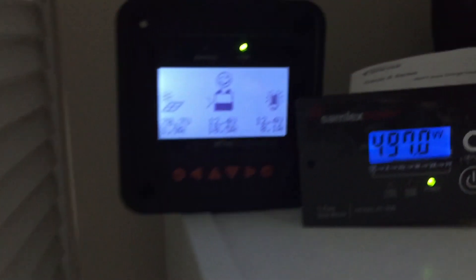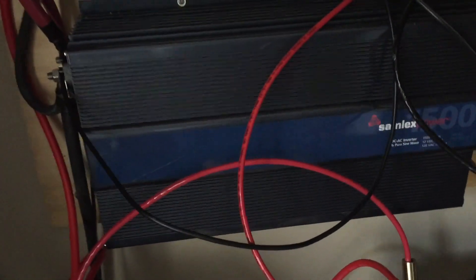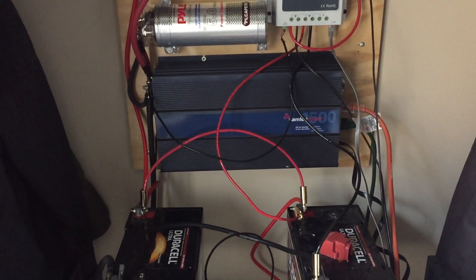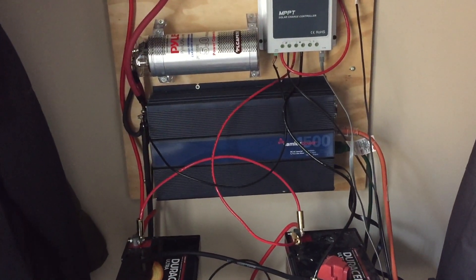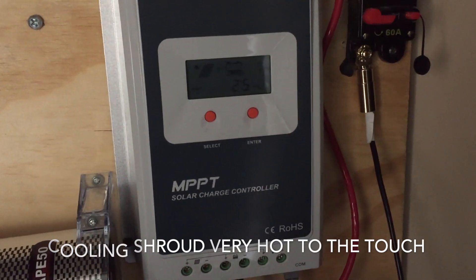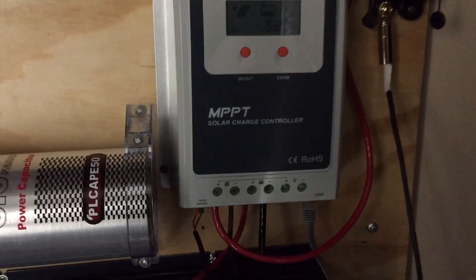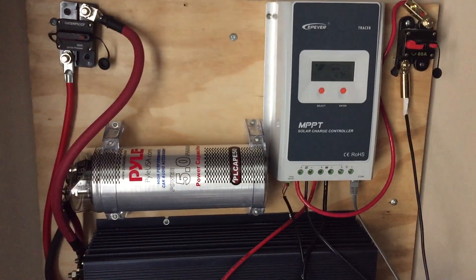It's after 12 and the air conditioner is still running strong. The inverter fan just kicked on — it's really not as loud as some inverters I've heard on other YouTube channels, so I'm glad I got this unit. I'll put a link in the description below. However, if you put your hand on the cooling fins of the charge controller, they are pretty hot to the touch. It probably needs a temperature-sensitive cooling fan added. I've seen a video where someone burned both of his up and had custom cooling shrouds made — that's something I'm going to have to consider if I run the AC regularly.